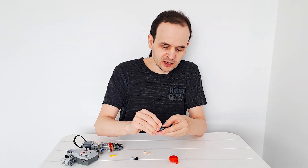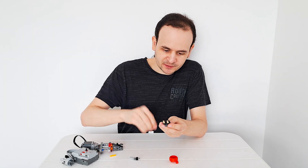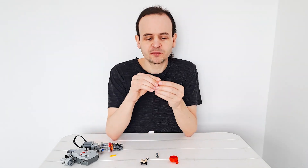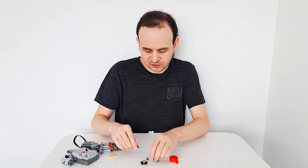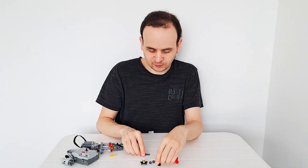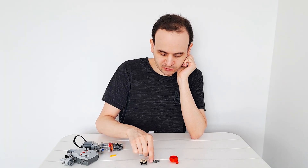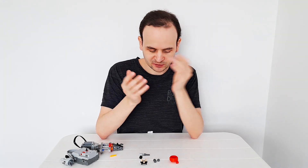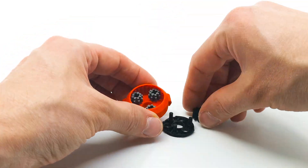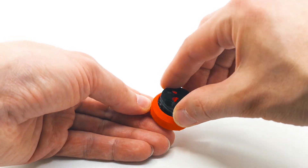I decided to use half pins to hold the wheels. I could also print the pins on this part, but then the part would be much more complicated and harder to print, so I went with this compromise. You might be asking why I'm using a 10-tooth gear and 8-tooth gears — why not just go with three 8-tooth gears? That is not possible because it's not a valid combination. You can use four 8-tooth gears outside or two, but not three, because that would be uneven — that's how planetary gears work. You simply assemble the hub, being careful to put the gears in proper spacing.